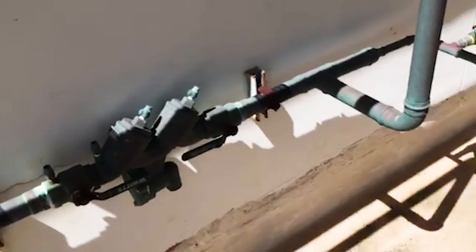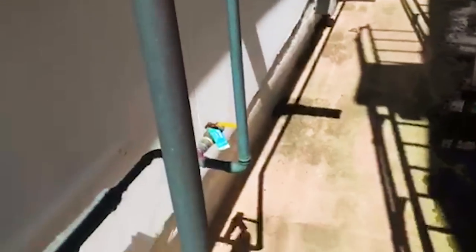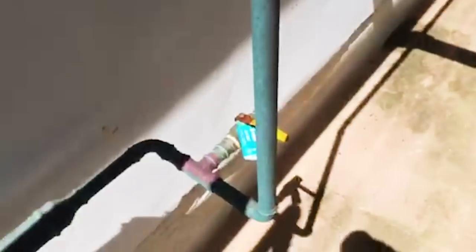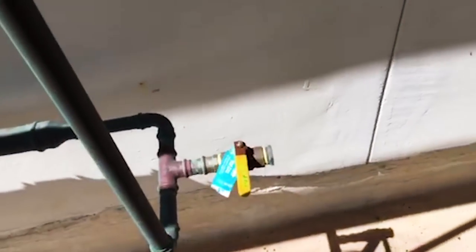This is where our water comes up from downstairs, stepping down our pressure — it might be a backflow device too. This is going to the tower, feeding water to the tower. This makeup water is going to our closed loop, which we will get to in a moment. Here's just a convenience water outlet — you could put a garden hose on there if you wanted to.